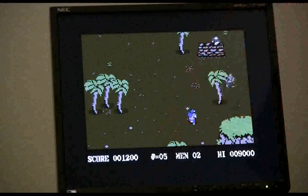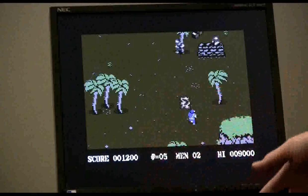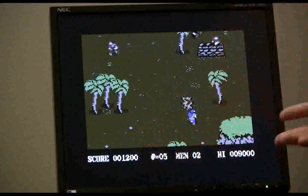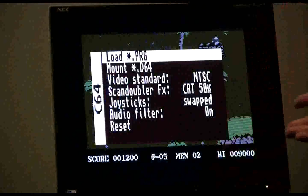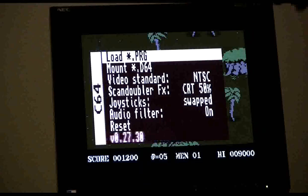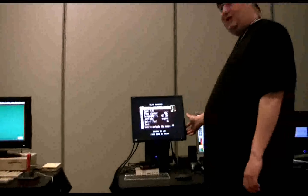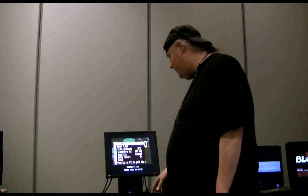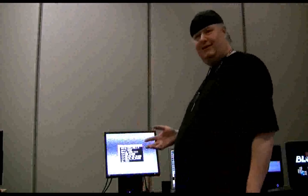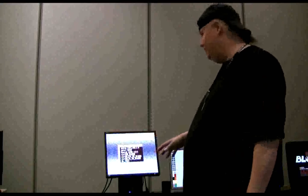It's all these things, a lot of fun. Music, and that's the whole SID emulation and all that. You say emulation, but it has a SID simulator on the FPGA, so it's pretty close to a real SID. A lot of times with emulators, the SID chip's a hard chip to emulate, so the sound doesn't sound quite right. This pretty much sounds like SID, exactly the same logic, so it's pretty much like a clone of the chip. And obviously you can have other things, like some people have the dual SID, the stereo SID, and hopefully at some point they'll add that in here as an option.